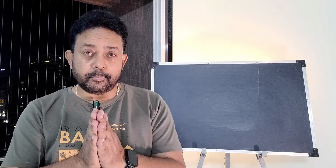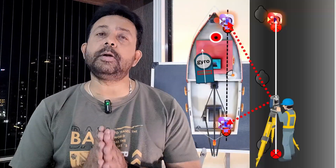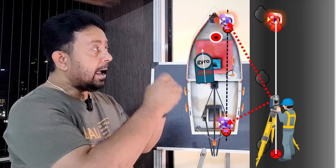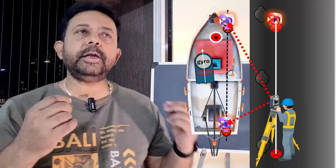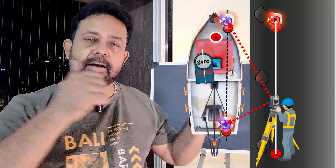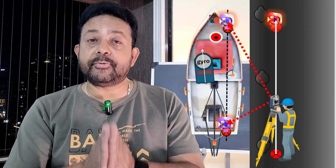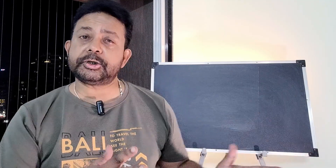Then set up your total station at one of the ground control points, take the reference object to the next ground control point, and shoot at the first prism. The process is that you need to shoot both the prism at bow and stern to find the angle and the distance, and you have to do that very quickly — within 10 seconds of time. You have to be very quick and everything depends on that. Once the bow and stern prism readings are taken, now you can breathe.